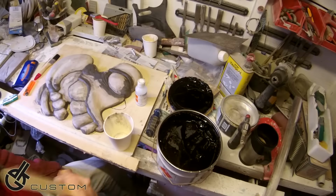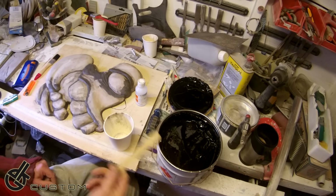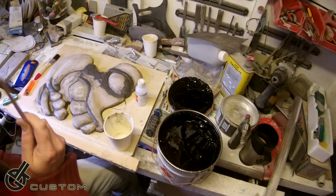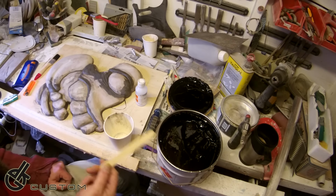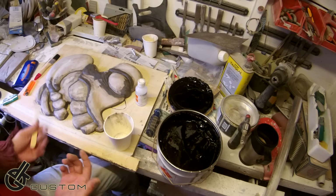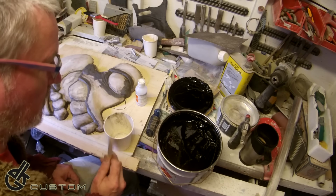We're going to start moulding today. Onto the bench. Okay, I have here a tin of what is called gel coat. It's resin and styrene. It's going to be what we use to put the first coat onto the mould. It allows you, once the mould has been cast, to do a little sanding, a little bit of clean up, polish it up, all these sort of things. Now, you don't have to use this when you're moulding, but it helps.